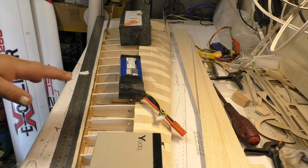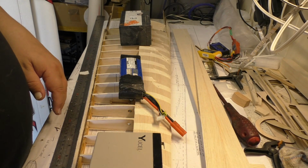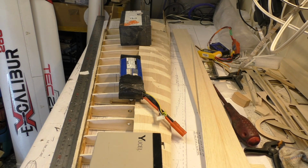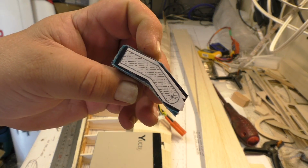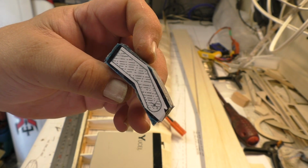Okay, so the wing is now drying off there. While we're letting that dry off, I need to make some more of these glass fibre parts for the hinges. Now, we already made one set for the ailerons and the flaps. What we haven't made yet is the arms that actually come off the wing and the ailerons and flaps bolt to.